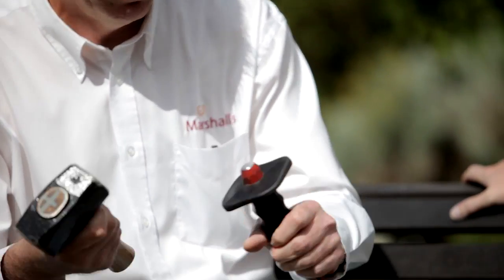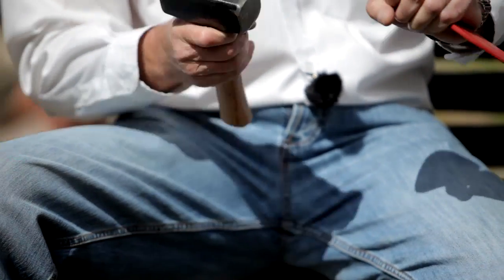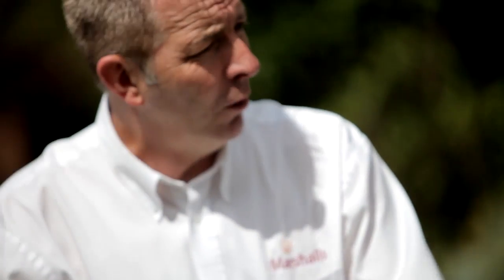And this? Again, a bolster chisel — both go together with the lump hammer. If you're doing block work, brick work, breeze work, you strike your line down, down it goes, splits your block in two, gets the size of block you want.